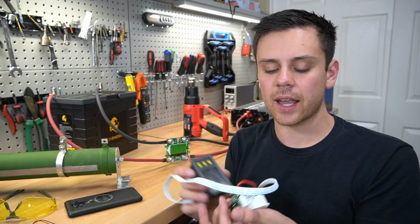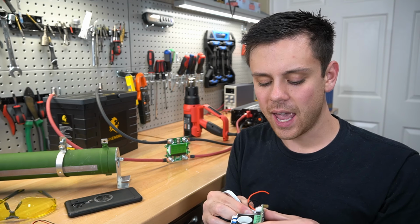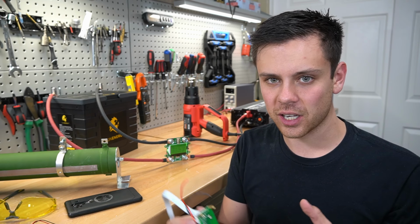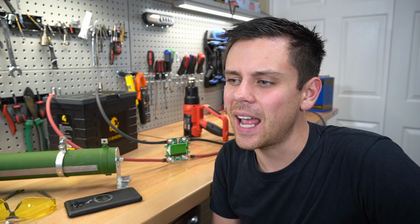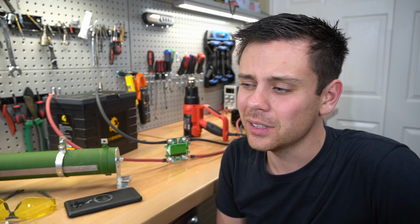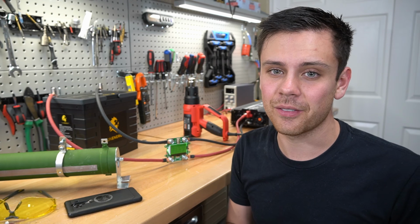I think this one's the most accurate, the Hall effect sensor one, because these just work in a very simple way. If a shunt is not manufactured properly and that resistance is not just perfect and it overheats, the temperature coefficient can change the resistance, and you could get inaccurate readings with a cheaply made shunt. But I've actually never seen a shunt be inaccurate. That would be really hard to do too, because they're very simple little devices. I don't even think the tolerances need to be good. I think just the quality control needs to be good, making sure that the metals in the mold got hot enough and it's actually tested before it leaves the factory.